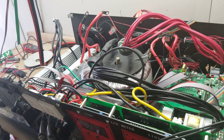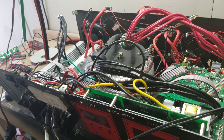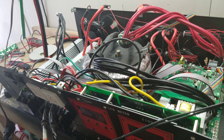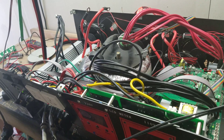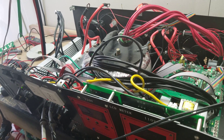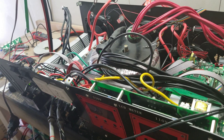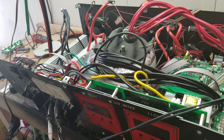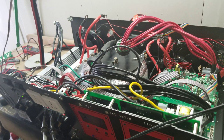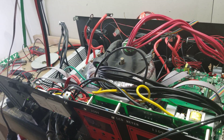Going back to when I got my first inverter — actually late 2016 — when I got the new 2017 7.0s, I was having an issue with L1 having noise on it, and it was blowing things like LED lights. That was before I got an oscilloscope. I got one of those little handheld oscilloscopes and found out there was a terrible amount of line noise on L1. Going back and forth with PowerJack, they didn't really understand at the time what was going on. Eventually they discovered it themselves, but it went all the way into the 2018 units. It didn't affect everybody — it was a small sample — I just got lucky and got the bad transformer, and I got it twice.